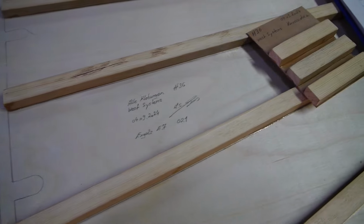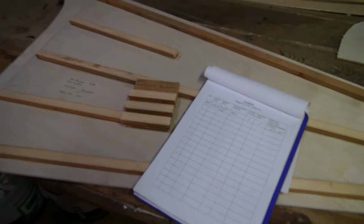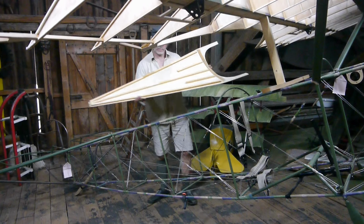Here too, we lock everything we can. Component, proof of glue, proof of curing, locks, everything listed in detail. In this case, glued with West Systems resin, as it is not a load-bearing component of the aircraft, naturally after consultation with the building inspector and the surveyor.